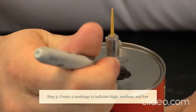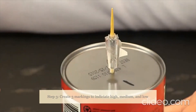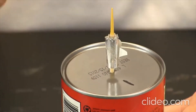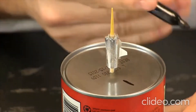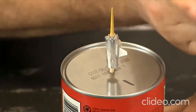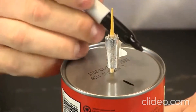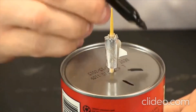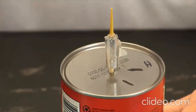I need my starting mark, so I'm going to line it up with where my pointer is right now and put a little line. This hygrometer works on a really simple concept: if there's more moisture in the air, this little foil pointer is going to want to unravel and open up. So I'm going to put another line over here and write an H next to it, because that means high humidity.